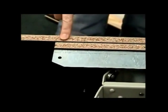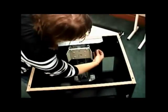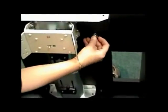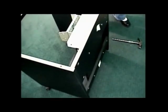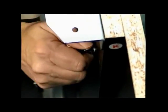Always make sure and check that the tops of the 2 panels are level. Next step is to put a washer and a wing nut on the end of each of the 1/4-inch carriage bolts and tighten it. On the back side, you will notice the carriage bolt sticks out slightly. Tap it in place with a hammer and completely tighten from the inside on all 4 of them.